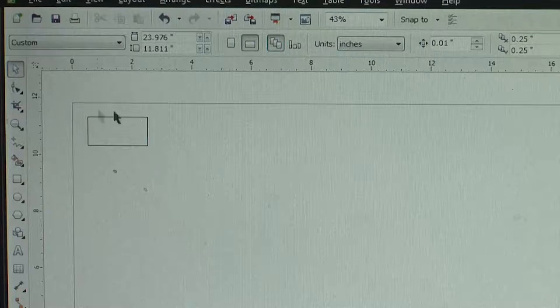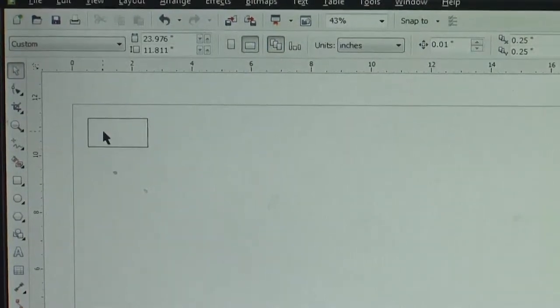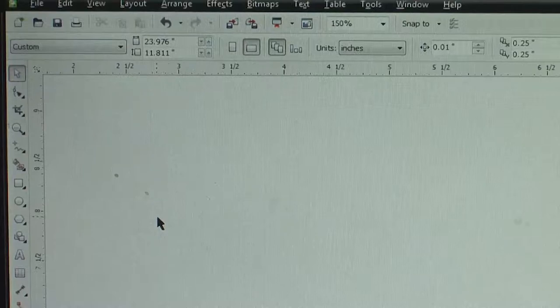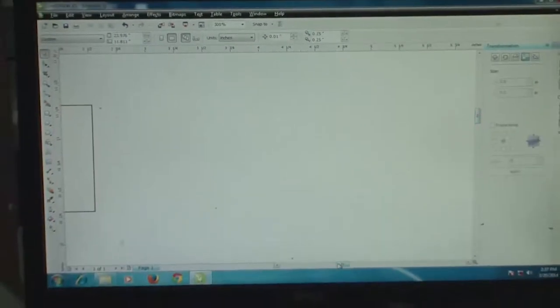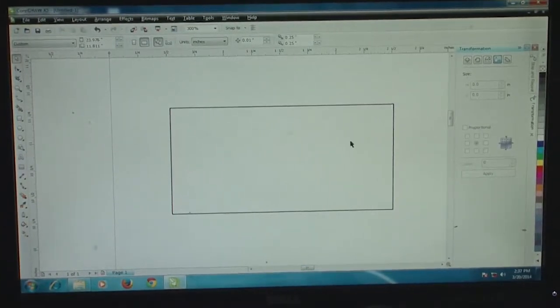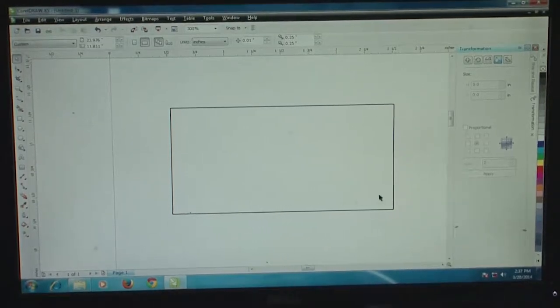Now, this die size is very small for laying out features which would eventually get engraved. So, I am going to use the center scroll wheel of the mouse to zoom up and align myself to the center of the die that has been created, and we can draw the features that we want in this zone, which would get engraved onto this die.